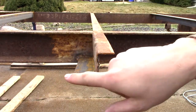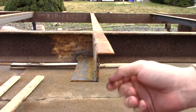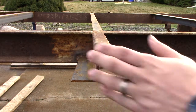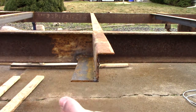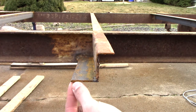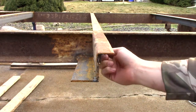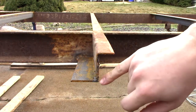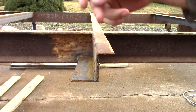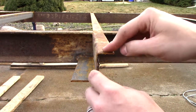This piece didn't originally have this extra reverse-L on it for rigidity. It was just this piece that came down and stopped, and you could take it with your hand and pull it — it would just bend completely out of place. To add strength and rigidity, I took eighth-inch two-by-two angle and welded it going the opposite direction along the underside, then put a little cap on the end. This creates a kind of homemade Z-channel, which ends up being pretty stiff even with thin material.